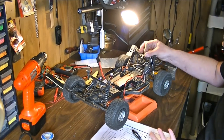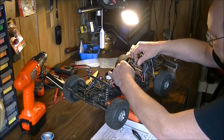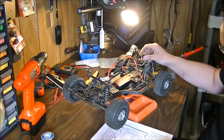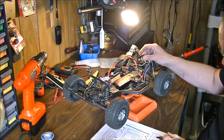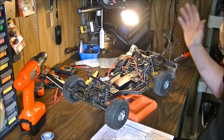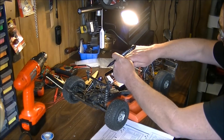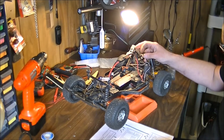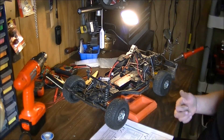In my case I don't have the switch, so I hold the battery connector and make sure I'm at the right polarity. I hold it — that's the first beep — one beat, two beats, three beats. Press the button, let go, you'll hear that sound and you're done. Unplug and plug back in. Once you release that programming button on the value you want set, it'll do a small delay and then chime — that's saved.